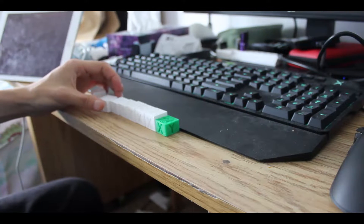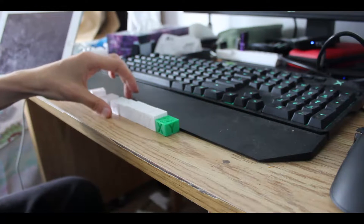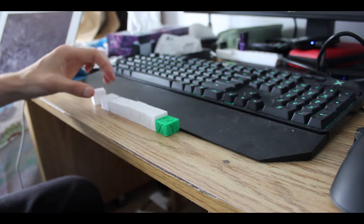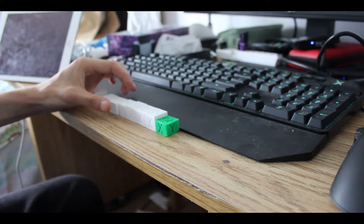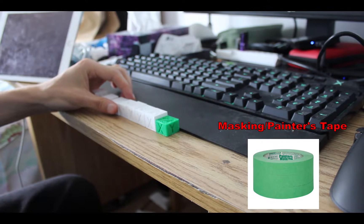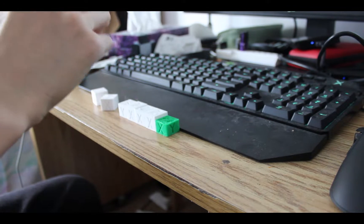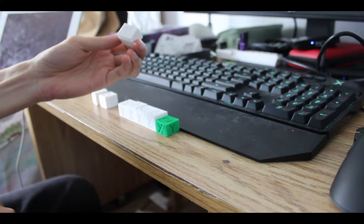After I removed the bed, I thought it might now be good. So I re-leveled the bed and now it's printing on glass. But since glass has a low coefficient of friction, the print doesn't stick well to the bed, so I had to use some masking tape. As you can see, there are some masking tape marks on the second cube here. But this was the result — it still has the same problem.